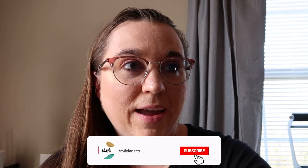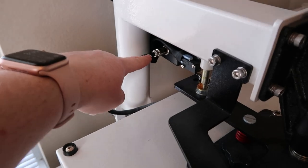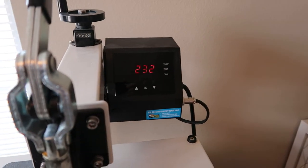I made a silly mistake - I turned my heat press on but it wasn't heating up and there was an error message on the screen that said '458.' I've never seen that before, couldn't find anything online about it, and even called in. They said to send a video with the details. Then I discovered this cable was not plugged into the machine - it's very important because it connects the platen to the control box. Dumb mistake but lesson learned, we're heating up now.